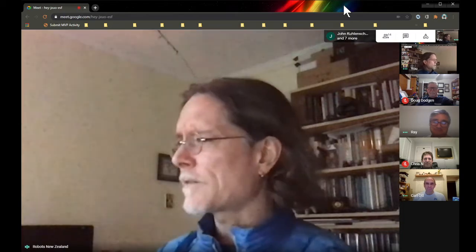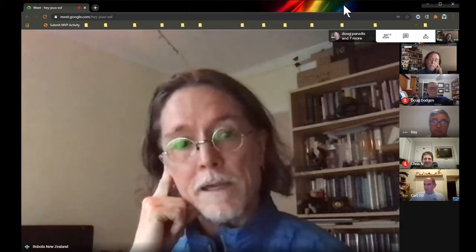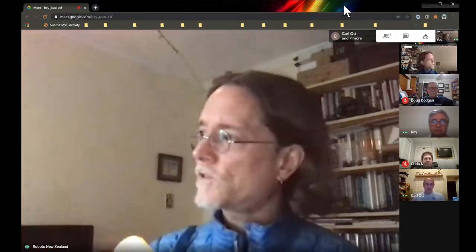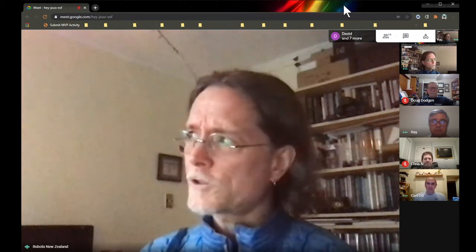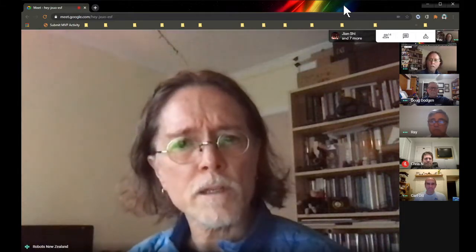Trying to think if there's anything else going on. Oh, I was going to ask if anybody has any experience with a Swedish company called Acconeer. They make small radar boards, and the cheapest is about $20. They go up to about $180. They're SPI based, not I2C, and they have a range of 1 meter to 10 meters or something like that. You've got two options of 40 or 80 degrees on the spread. Anybody here have any experience with any of these?